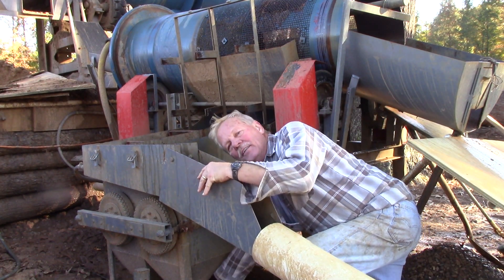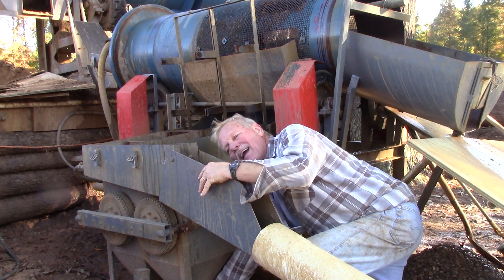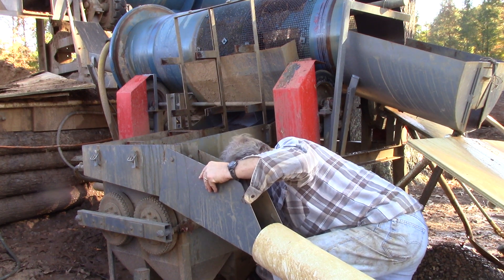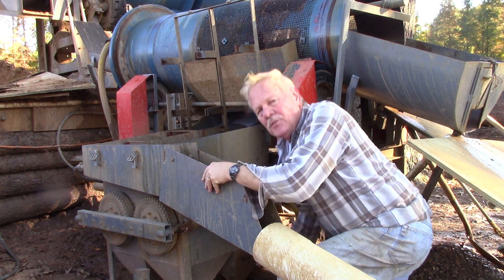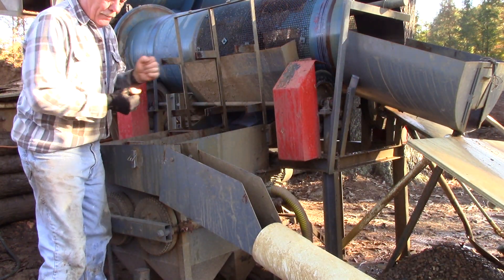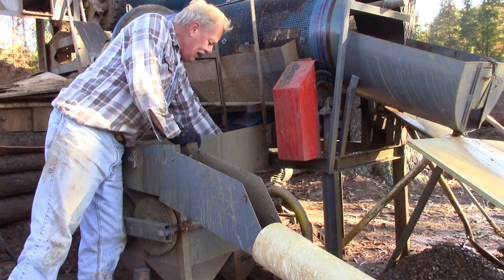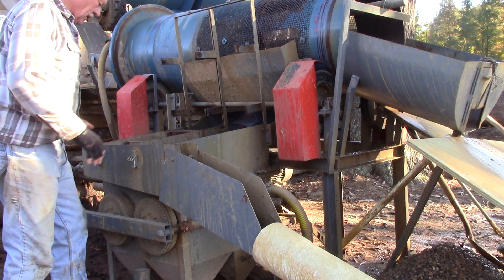There are four vats and there's a valve at the bottom of each vat. I can open it and drain it, get the water and mud out. We had trouble with it filling with sand and mud and packing in there so tight with the jig packing that sand in there that it wouldn't drain. So we put rubber inserts in there to open a path, so that if it ever floods you'll at least have that much of an opening to start draining and then it'll eventually work down.